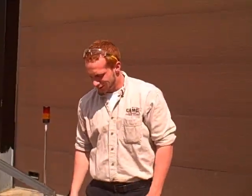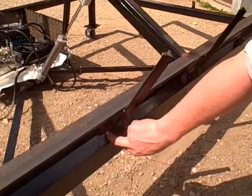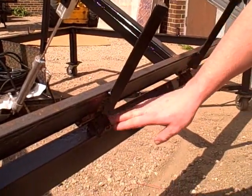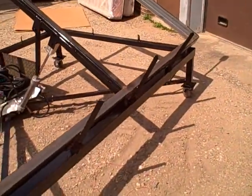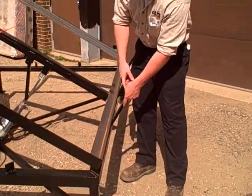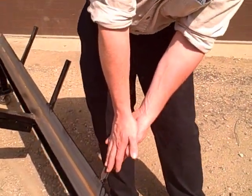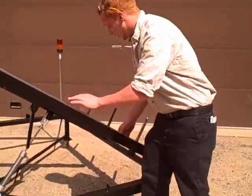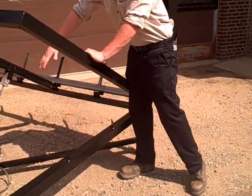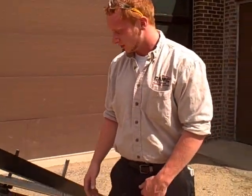On to metal fabrication. We started by thinking that these hinges here would be enough with a quarter-inch tab by 2 inches, but then we were wondering once we put all that force on there, that it would just bend over the tab. So we had to put angled iron on there and weld it tight. Another problem we ran into was this angle here — the weight of the bed coming down on the box spring would bend this, so we had to strengthen that up. And then our other design change was these two angles right here. For the force to come down on the cylinder, it would have bent the frame, so we had these supports come together so that it wouldn't bend it.